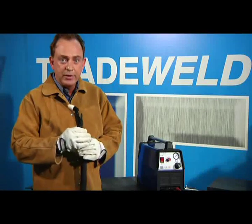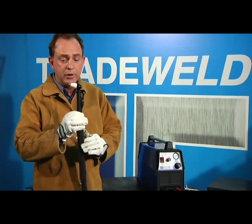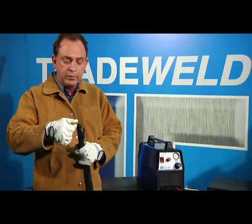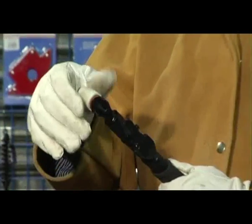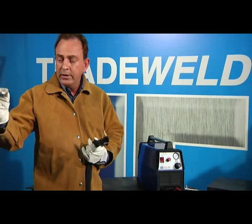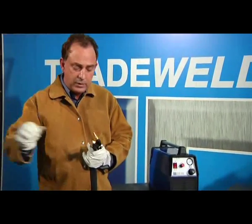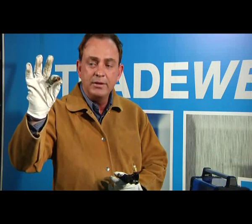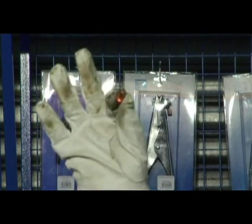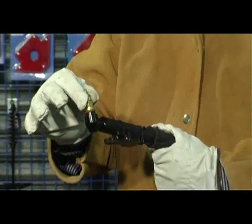It's very important to understand the consumables that are used on the torch. These consumables need to be kept in stock at all times. We'll start off with the outer nozzle. It is a ceramic nozzle that once chipped or burnt should be replaced. Then we have the cutting tip, which is a little copper nozzle. Once it's distorted or burnt, it's time to replace.